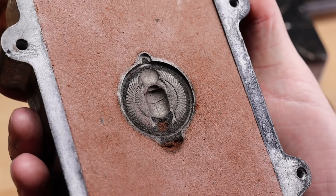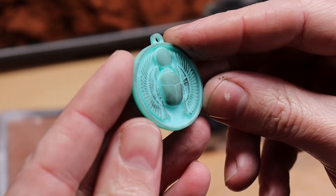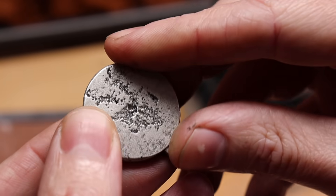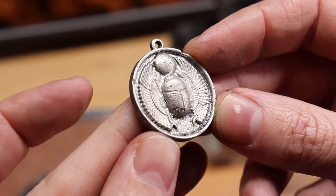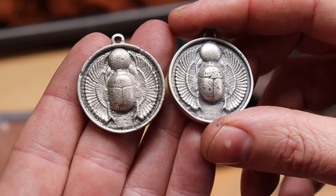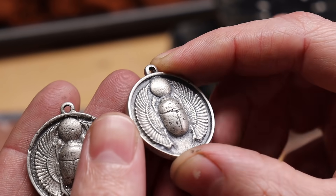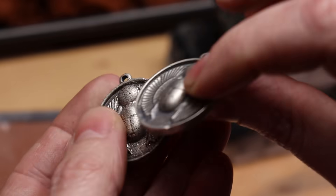So as you can see, in the actual Delft Clay I've already used it and made a casting. And this is a scarab — it's 3D printed using a resin printer, so you can see all the little details in it. It was basically just used as an impression to make this, which is very pitted and missing some pieces here and there, but for the most part actually looks pretty good. These are both solid silver, so I'm going to cast both of these.